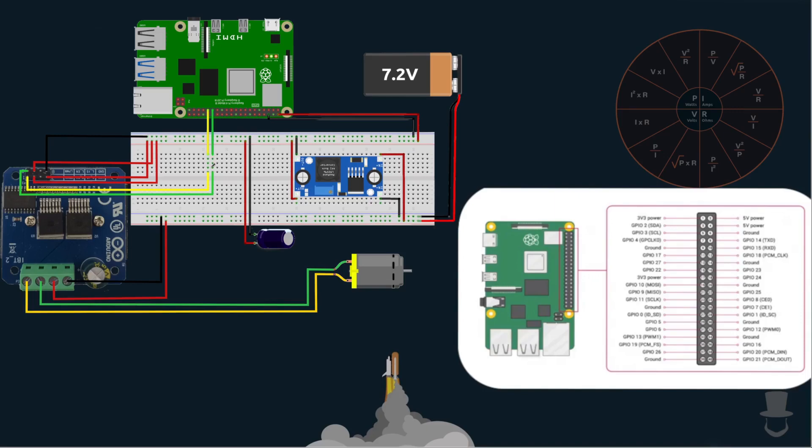You can actually go straight over to the Raspberry Pi, but in my instance I'm going to be using an oscilloscope later in the video just to show you the actual PWM signal — that's why I have it hooked up to the breadboard like this. I'm using a buck converter to convert 7.2 volts to the 5 volts I need to power the Raspberry Pi and also the H-Bridge controller. You can also power the Raspberry Pi just off a USB-C — you don't have to do it off the 5-volt pin and the ground pin. You do need to tie the Raspberry Pi's ground to the ground rail though.